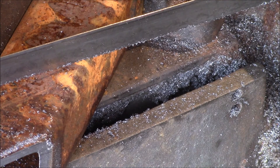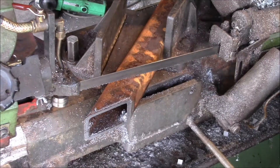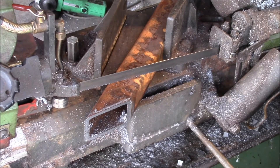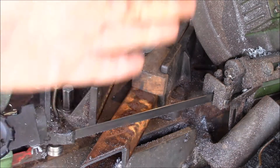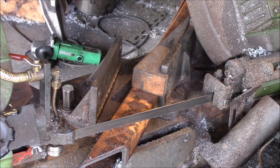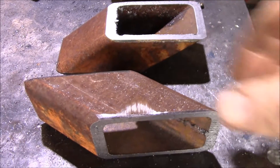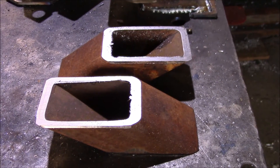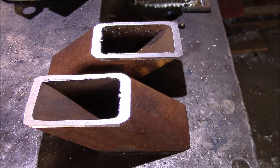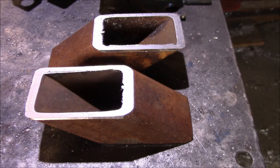That's where the shadow line really helps for setting up these cuts. I just wanted to show you that acute angle cutting setup — it really helps make repeatable angle cuts and you get nice square cuts because everything's anchored down. I've got the spacer pieces cut and the plates cut, so now it's just time to weld them together. Here's the finished cut.